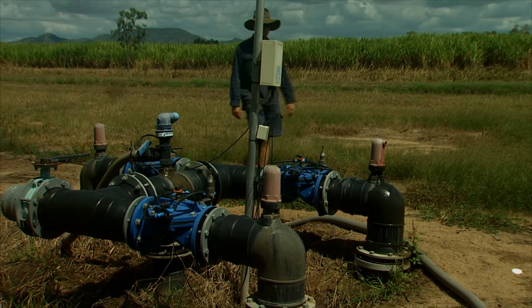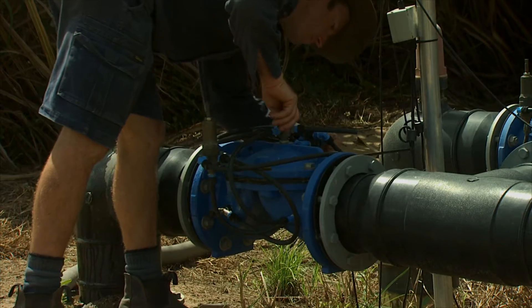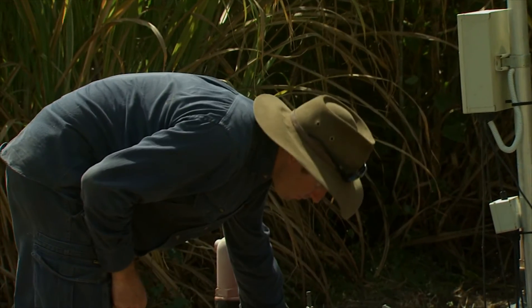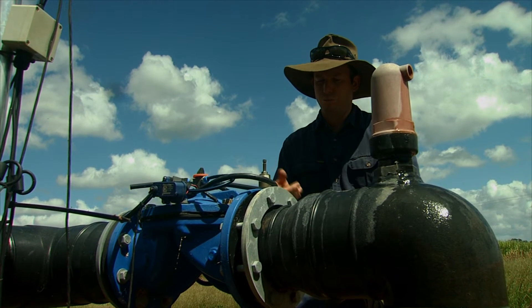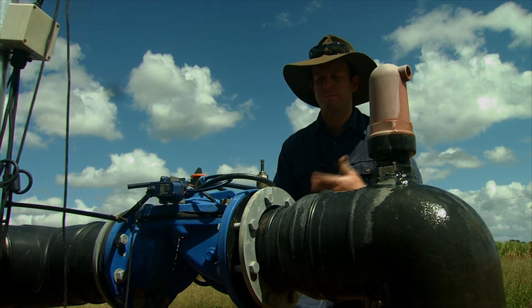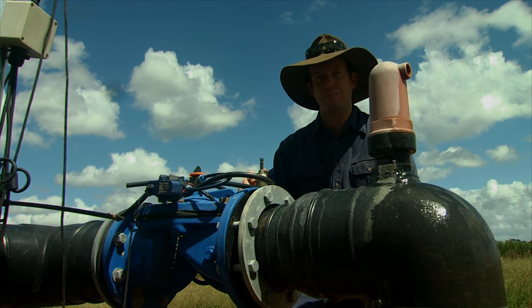The variable speed flow control system inside the shed is linked to the underground drip irrigation network out on the blocks by radio control. Flow is maintained using a system of valves, ensuring water and nutrients reach the crop at the required rate. I've just turned this valve on to automatic — the water is being vented off the top of this valve through a little vent to alleviate any water hammer in the line.